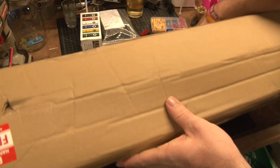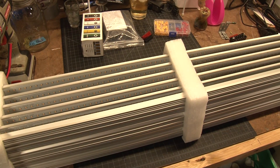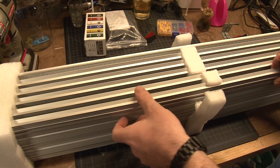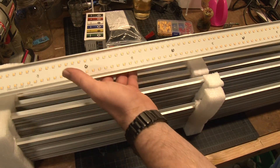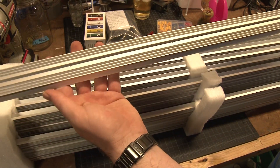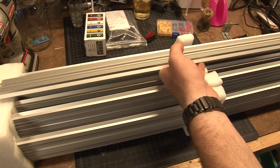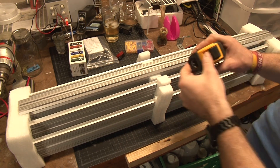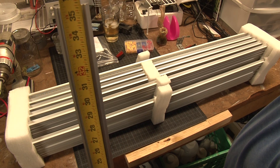Let's take a look at the LEDs in question — these are from Linear Pro, their XPE bars. Right off the bat, they come already mounted on heat sinks, which I really like. The heat sinks are angled so they act as reflectors, and they have a T-slot in the back that fits a number-8 screw or an M4 nut.